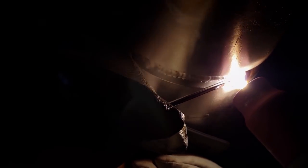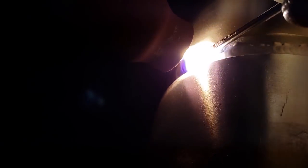When it comes to brushing the metal, you brush always only in one direction, whether it's a downward stroke or an upward stroke. The reason for this is because you brush in one direction to remove the oxide, while if you move backwards in a returning backstroke, because the metal is soft, the bristles not only chew into the soft material but also embed the oxides in deeper.